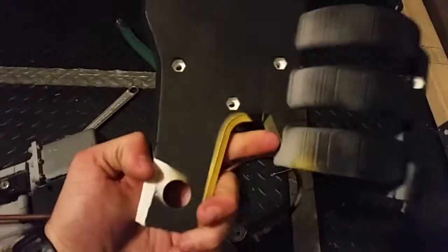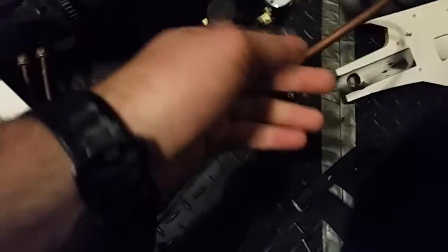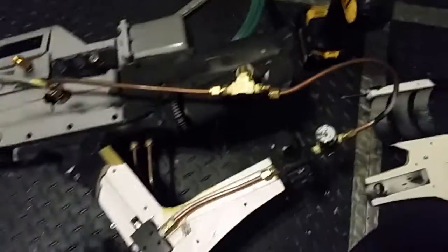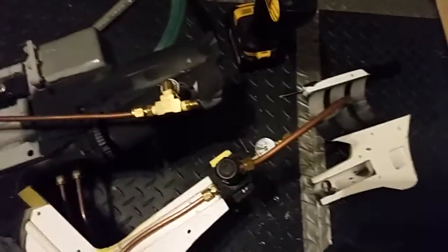Here it is with the CO2 tank port removed — that was kind of just for decoration. Here you can see these compression fittings. I wasn't entirely impressed with these compression fittings even though apparently they can handle a thousand PSI. They don't handle it well; there was a lot of leaks. They were cheap, which is why I went with them, but they really weren't equipped to handle this kind of an application. So I don't think I'm going to be using these compression fittings anymore.